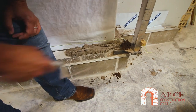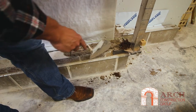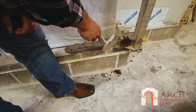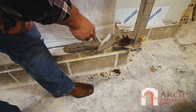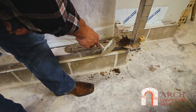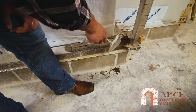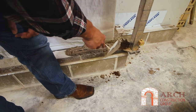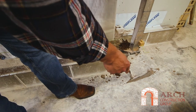If you hold your brick level and there's a gap, that's a place for mortar to ooze into. You'll notice I have a nice full spread here, but here I held back the spread — this is intentional. We're not going to be able to strike this bed joint beyond this bracket, so we don't want this filled with mortar. If it fills with mortar we have to chisel it out later.